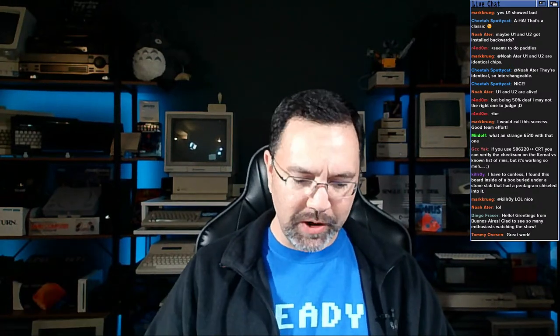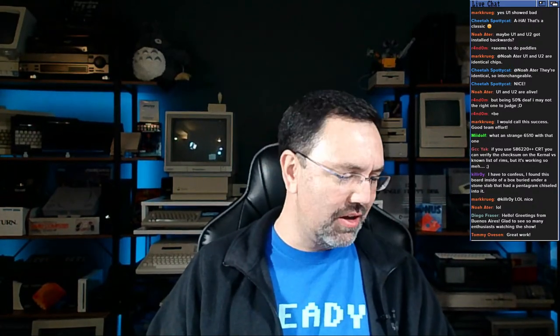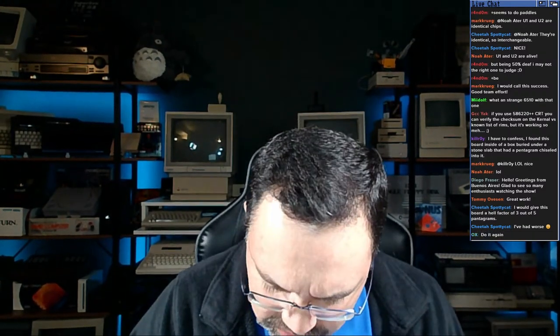With all of your help, we were able to figure out what was wrong with this machine. We learned a few things today, namely that there's a 1 mega ohm resistor in the anti-static strap, so you can't do a continuity check on that. Also, we learned that pin 6 and 7 on the MOS 8701 are not the same thing. So we have to make sure we're on the right pin when we're probing with the oscilloscope.